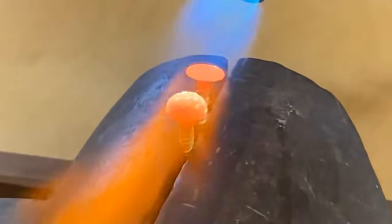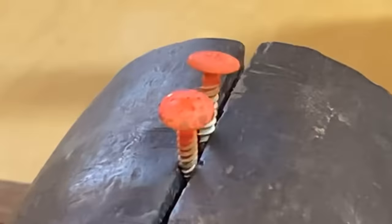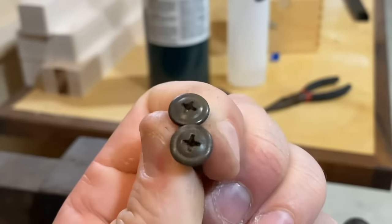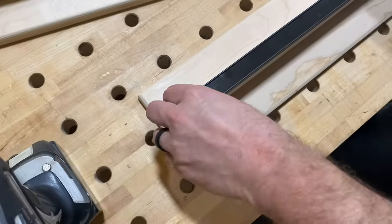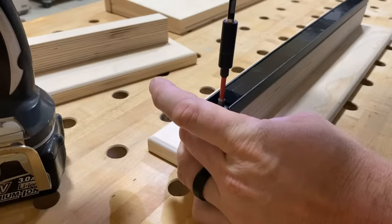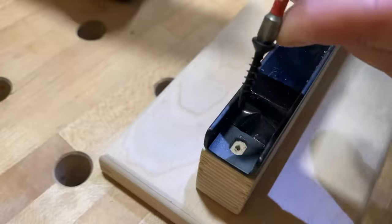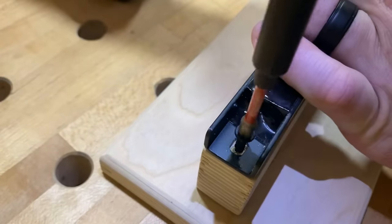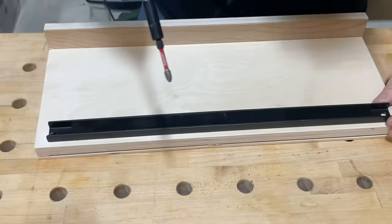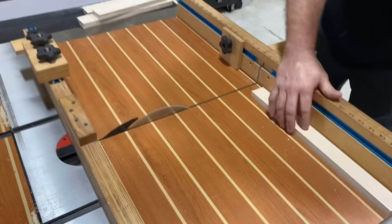This is an experiment — I don't have any black panhead screws, so I'm taking some zinc-coated ones and torching them with a blowtorch until they're piping red. Once cooled I scrape them off with a wire brush and they turn a pretty cool dark brown-black color. Honestly though, I actually had countersunk black screws available the whole time — why I didn't just use those in the first place I don't know, but I'm using them here now.